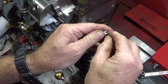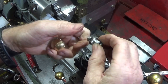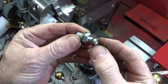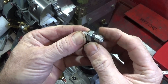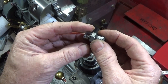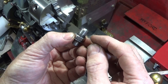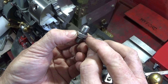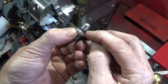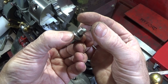I'll stretch it over the thread there. I could do with a slightly bigger one, but I'll stretch it over the thread. There's a small o-ring there. I'm pushing it down over the thread and down into the undercut there, and that will stay in that undercut — it won't come off when you put the lid on or take it off. Now all I have to do is machine a top with the thread to suit the 1/8th BSP, and put a small shoulder or counter bore in the bore which will go down over this o-ring. You just have to find the correct squeeze on the o-ring, and I'll explain that later.